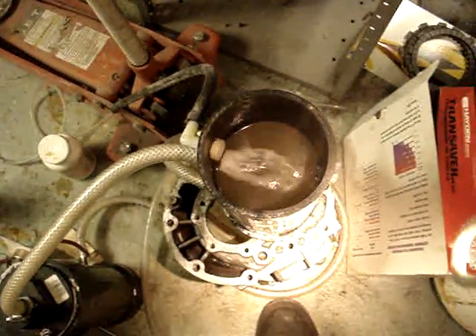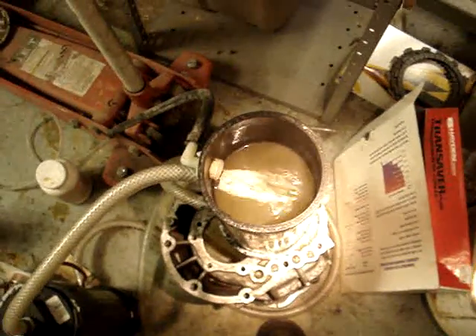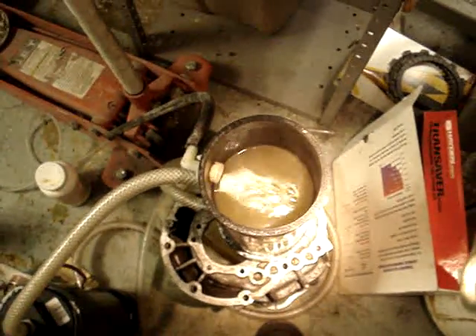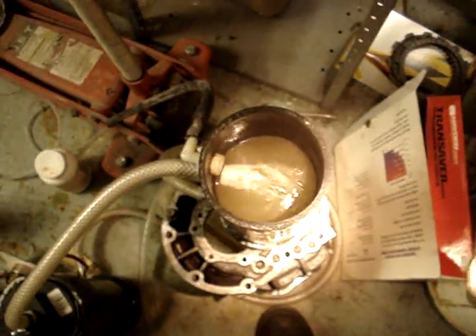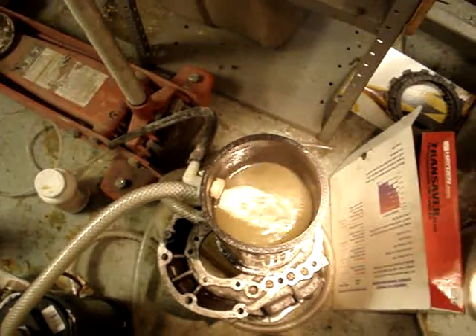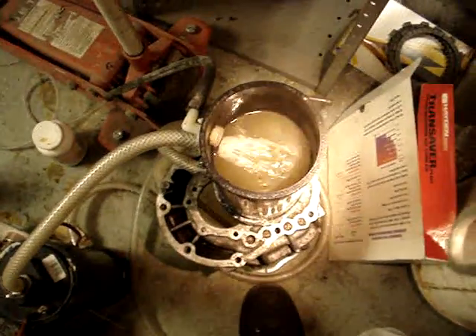It'll be a stainless steel tube and shell, basically a four-inch diameter tube, and then inside, sealed with O-rings and plates, there are 25 five-sixteenths stainless steel brake lines welded into an end plate. So the solution will pump through the tubes, and then separate from that, you will have 75% distilled water, 25% coolant on the outsides of those tubes, drawing the heat away from your KOH solution.